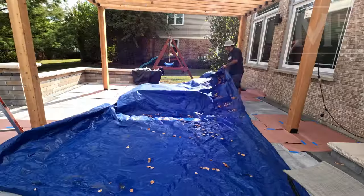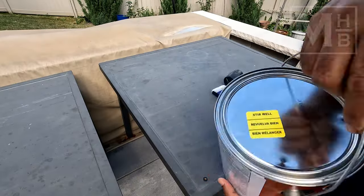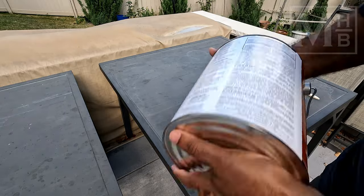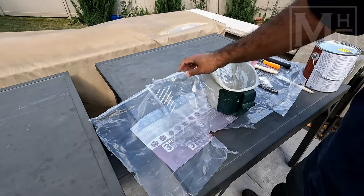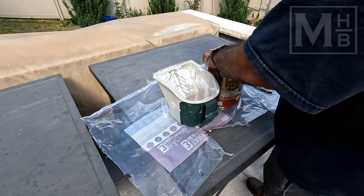Ready Seal is a penetrating oil, so I'm taking extra precaution and covering the patio as much as possible. The patio is sealed, but I don't want to risk any staining from the sealer. The instructions say to stir well and keep the can upside down for a bit. I did test it on a piece of leftover wood from last year just to make sure I was okay with the color — it makes the wood a little darker and it looks good.